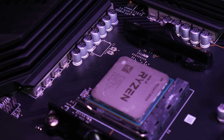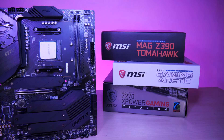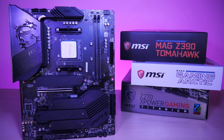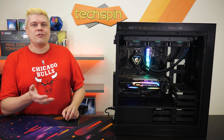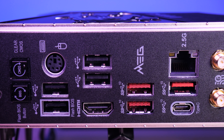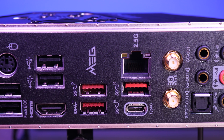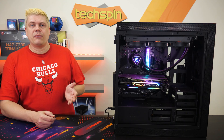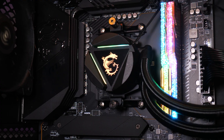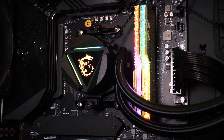There's a lot to like about the MSI B550 Unifi X. Build quality is excellent, the VRM design is great and sufficient to handle overclocking loads, and the all-black aesthetic with no RGB will definitely appeal to many. Having 4 M.2 slots with 3 at Gen 4 is overkill, but there are users looking for huge amounts of fast storage, so this fits the bill. Connectivity is very good with the amount of fast USB and SATA, though they did remove a PCIe slot to make the extra M.2 slots available. Personally, I would probably look at the non-X version for its 4 DDR4 slots vs 2, though the two here do support 64GB of memory — enough for most, provided you're buying more expensive 32GB DDR4 sticks.